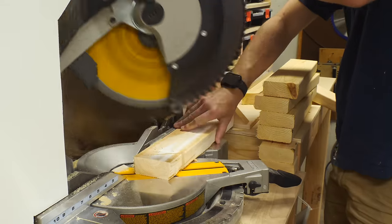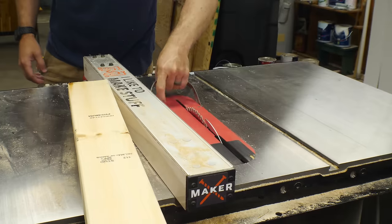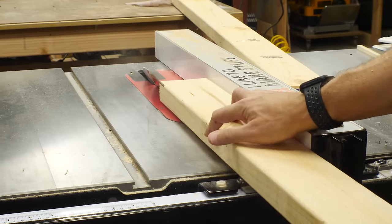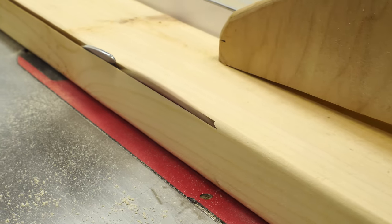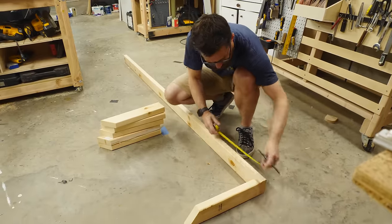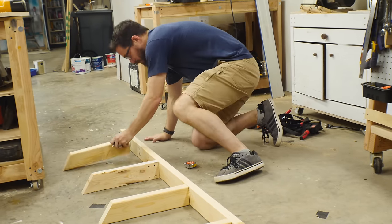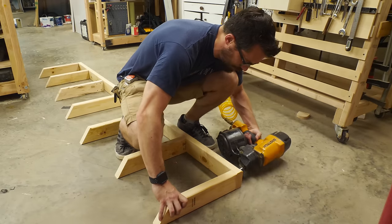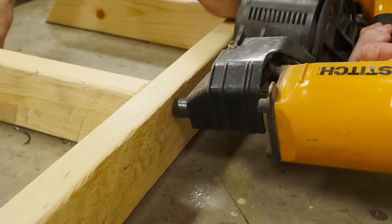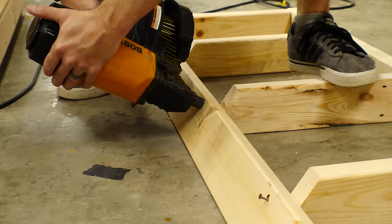I also cut down one long piece for the bottom plate and one long piece for the top plate, but that top plate needed to get an angle as well. I set the blade on the table saw to 35 degrees — that was the same angle I found earlier — then cut an angle all the way down the top plate. The reason this angle is there is so that you have a full flat wall with no angle at the top, which makes it a lot easier to put on drywall. Along the bottom plate I marked every 16 inches and centered each stud on that mark. I nailed these in with a framing nailer, then put the top plate against the angled part of the studs and drove in nails. I got the wall slid into place, made sure it was plumb, and hammered in nails down into the floor and up into the rafters above.